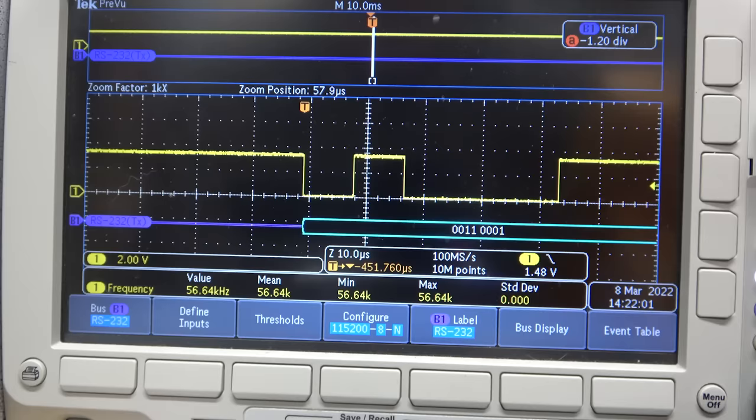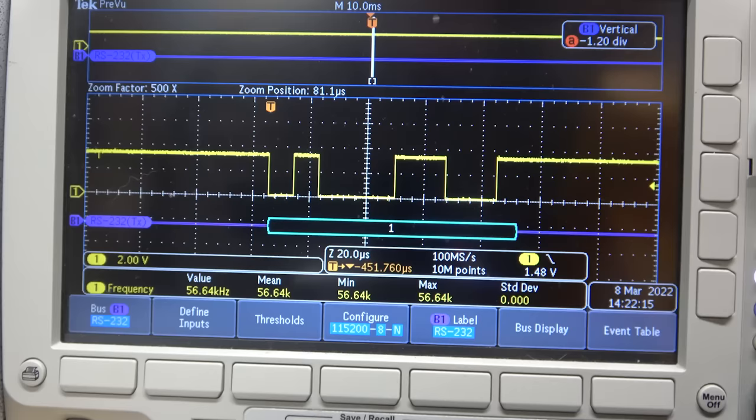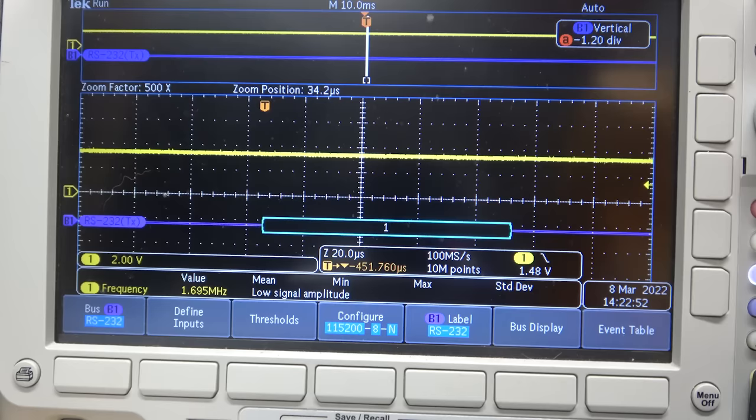The ASCII character 1. I almost said the numeral 1, but that's technically not correct. So this thing is sending RS-232 115200 serial back and forth between the processors. Jank mustank. So I wonder if this other pin that I didn't think does anything...